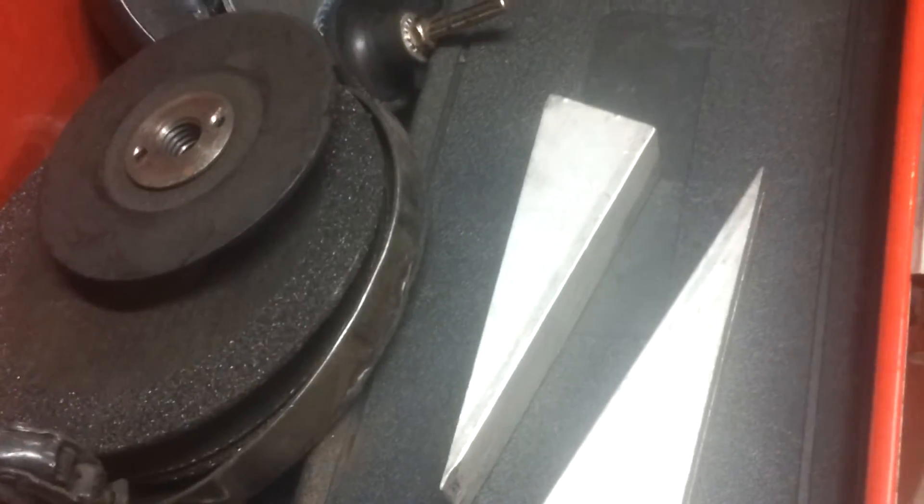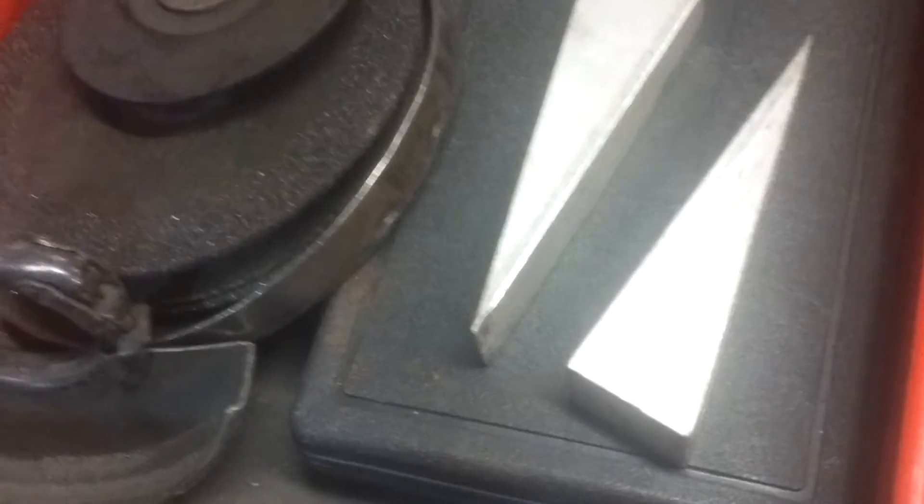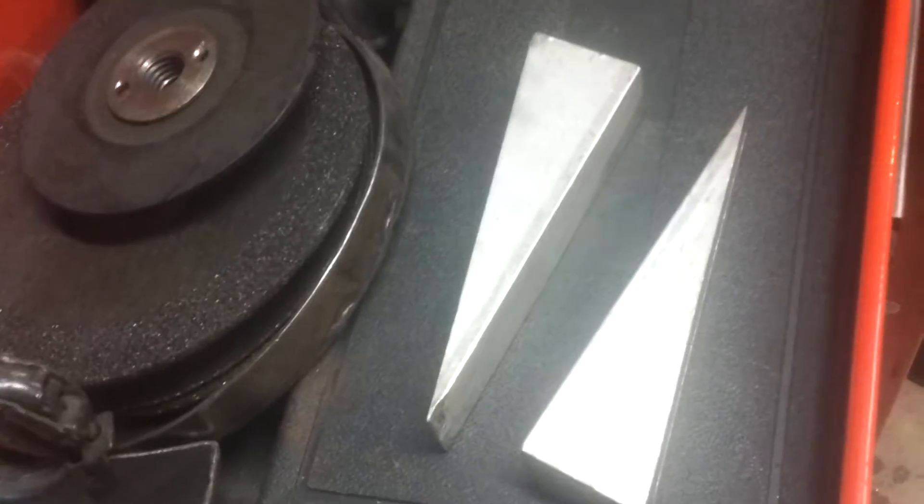These right here are really nice - these are homemade wedges. Great for getting up underneath a little piece of tube and knocking it around, holding it square, wedging things over to hold them at an angle or whatever. I use the aluminum ones because they actually dig in a little bit and they'll hold, they'll stay - unlike the steel ones which you pound in and they'll bounce back out. That's for fitting pretty big heavy stuff that you're trying to keep squared up so when you tack it, it doesn't move off to one side.